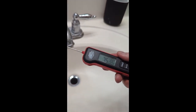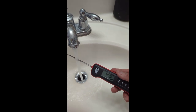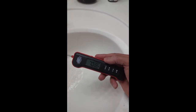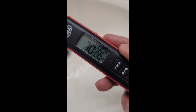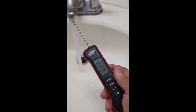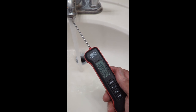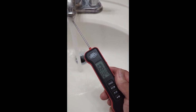Here I have my thermometer. I'm going to turn it on on the cold side. As you can see under the cold side, you'll start to see it drop — we dropped about five degrees. The ambient temperature outside right now is about 75 to 80 degrees, so this is about right. When we turn on the hot side, you'll see the difference. The water is holding at a steady 106 to 108 degrees.